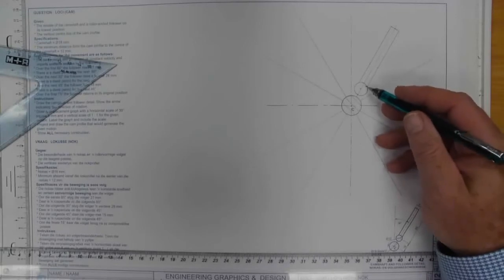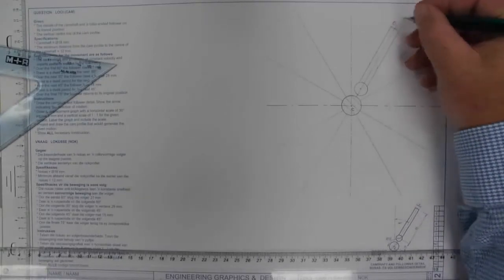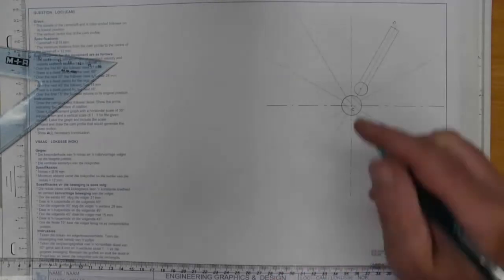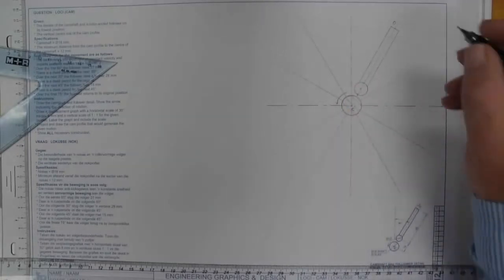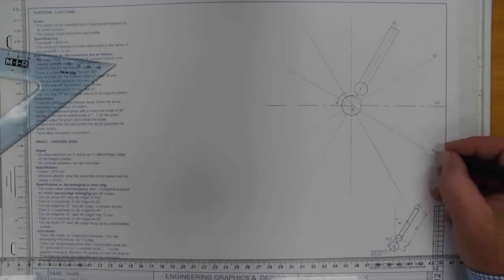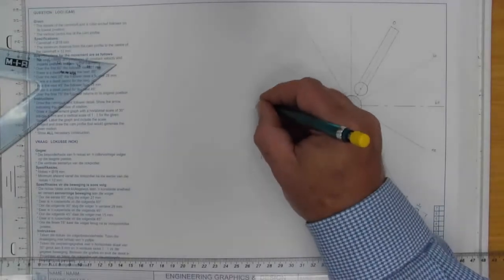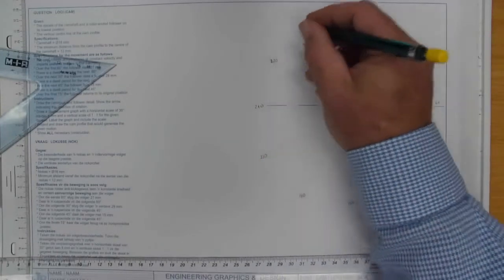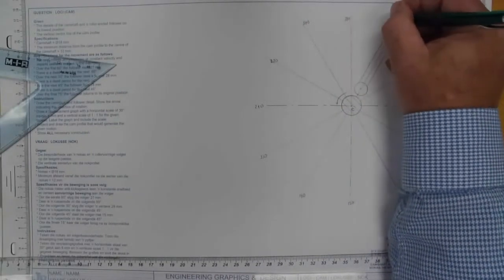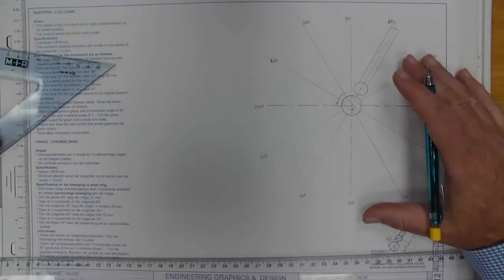So there, grade 11s, I've done some of the work. I've drawn my camshaft and hatched it with a diameter of 18. I've put in my follower with a roller bearing, diameter of 12, and the rest of that follower. Now if we label that, remember 0 is where my follower is always. They've said that our direction of rotation is anti-clockwise, so our labeling must be clockwise. So there we've done that given stuff. Now we need to do the displacement graph.